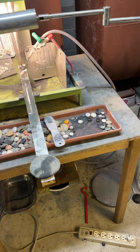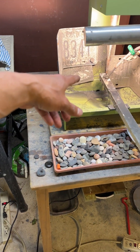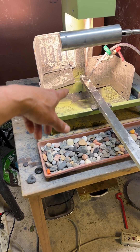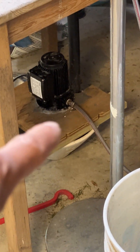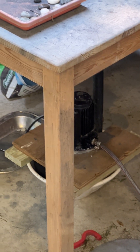Because if it's too low, it starts catching the grit — the rock grit — and they clog the pump. I have a solution for that that I just haven't implemented yet. I'm going to put a strainer right there so when the tube makes the hole, the strainer catches the debris. I need to go to the plumbing store — I'm going to put it in a two-inch pipe with a bigger metal strainer, attached to the wood below with a cap, and the black poly tube will go inside so it's easy to open.